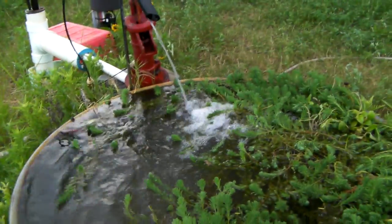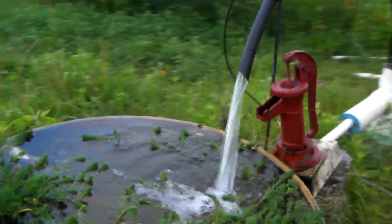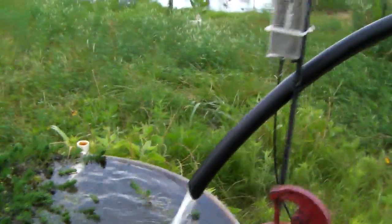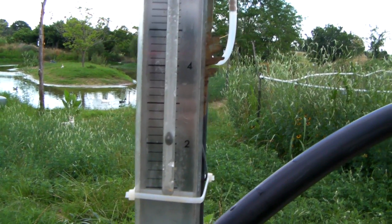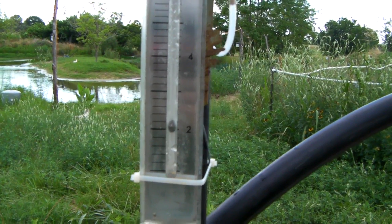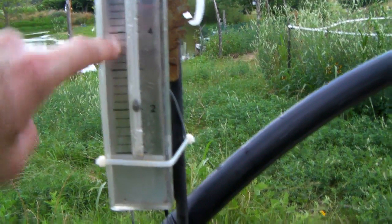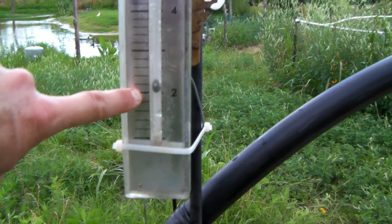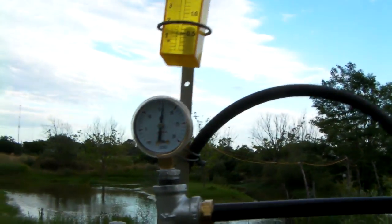This is definitely working great at about 13 gallons per minute. I've tested upping the CFM to three and four, and it raised my gallon-per-minute by maybe half a gallon — maybe 13.5 to 14 gallons per minute — but I had to double my CFM, which wasn't worth it. So I'm going to order a compressor that'll do 2 CFM at around 25 PSI.